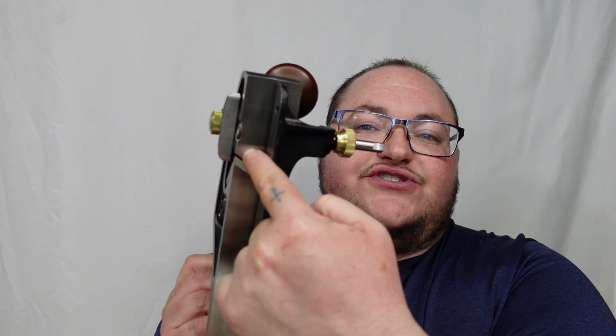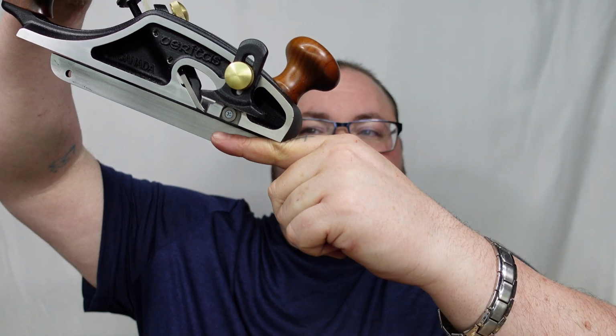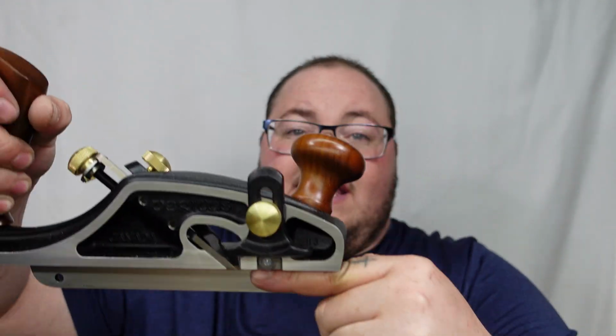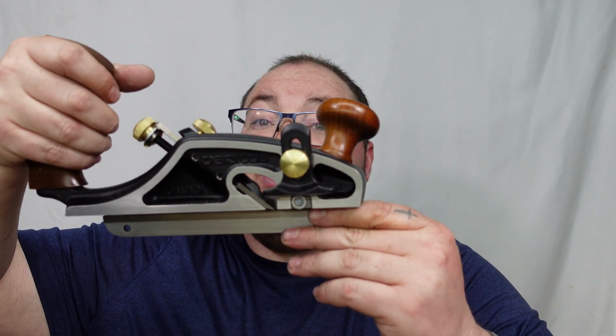The other thing I noticed is just go for it. Just plane. The slower I went, the worse it was, to be honest with you. If you just plane, it was referencing very well and it was staying very square doing it that way. The other tip that I have is there's a lot of reference area right here, so use that to your advantage when you're starting a cut. So what I would do is either tilt it this way and drop it down, or tilt it this way and drop it down, and then push it against the board. So tilt it, drop, push against the board, and then plane. Use that to your advantage. It's very, very helpful. It's also good to get it set up and help it get square, so then when you just go for it, it stays in that position.